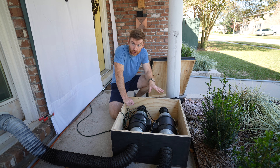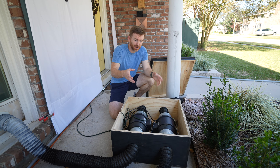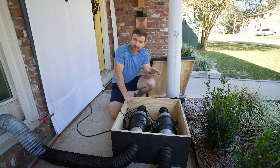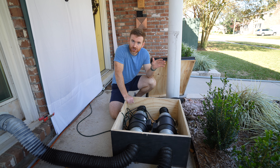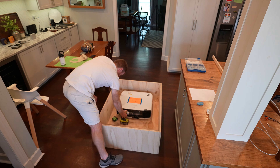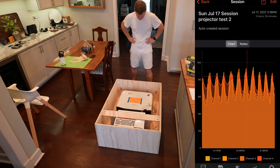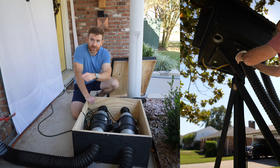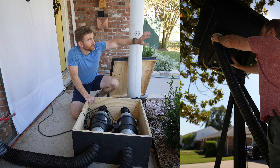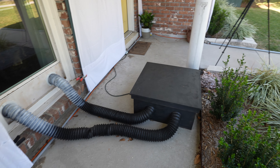Due to the projector's user manual, it cannot experience relative humidity over 80%. In southeast Louisiana, that's basically every day. To mitigate the issue, I tried a bunch of different things — first I tried a small window unit inside the massive birdhouse, but the temperature swings were way too high, going all the way down to 50 degrees and back up to 100. What I came up with was two inline fans and four-inch ducts that run out to the giant birdhouse and back. One fan pulls air from the house and pushes it out to the box; the other pulls air from the projector and pushes it back into the house — circulating that air and keeping it nice and dry inside the birdhouse.